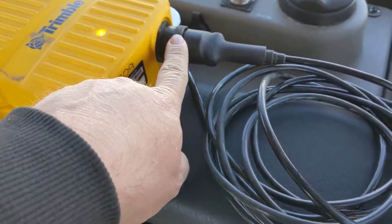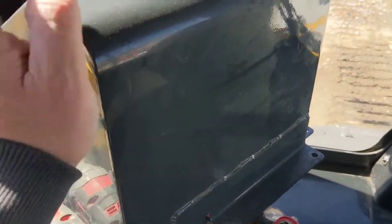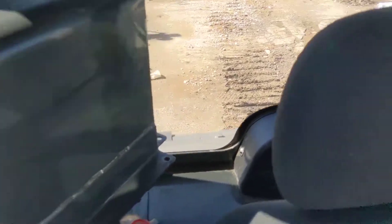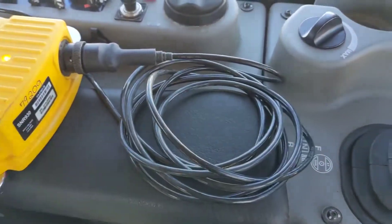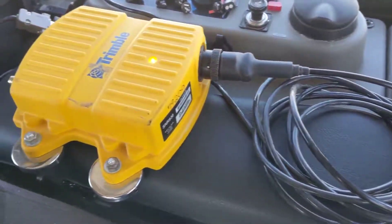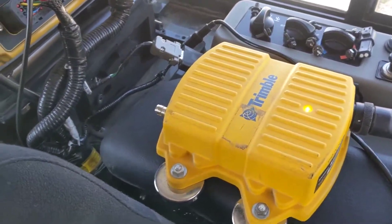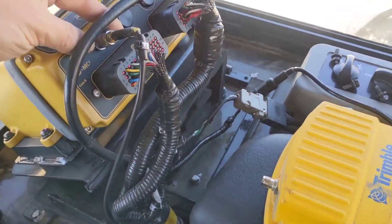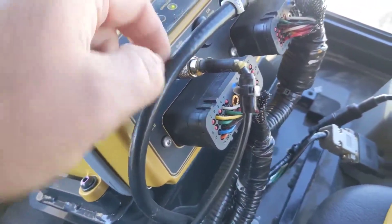It's pretty easy — it's got a mil-spec connector that goes into the bottom of the radio. We typically just mag-mount these onto the side of the case to make them easy in and out. If you do want to remove them you can install them outside — that's why the cable is long — but I usually run them inside. On small enough sites we don't have an issue with the antenna being inside.